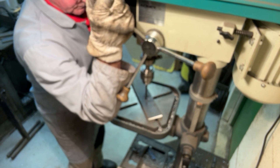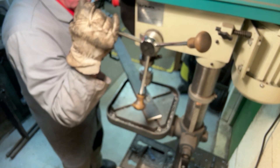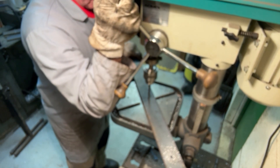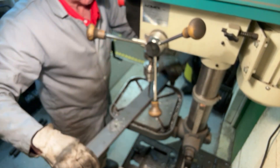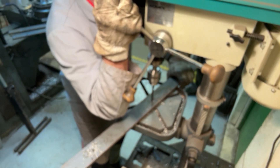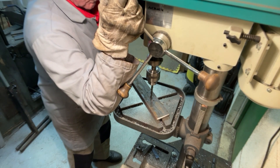I've started drilling the holes in these plates. I'm using a seven millimeter drill as a pilot drill. The plates are 60 mil wide by 10 mil thick, and there are quite a lot of holes to drill, so I'll just work my way through. I've sped it up a little so you don't get too bored. There's quite a bit of pressure on the drill press, but they're going through okay. It's not the best steel for drilling - it's a bit coarse - but they're drilling out fine.